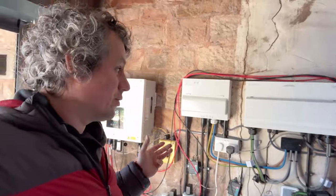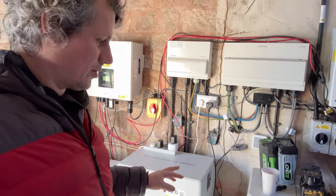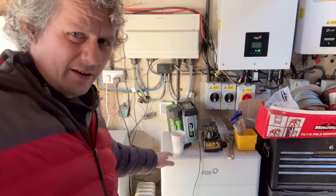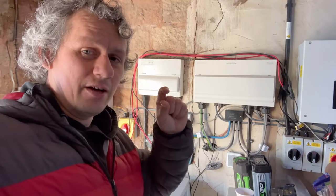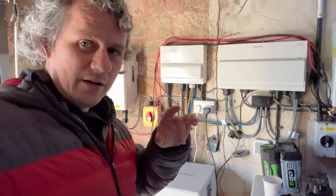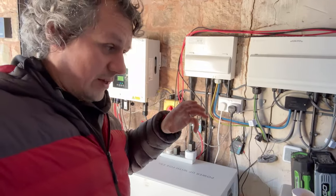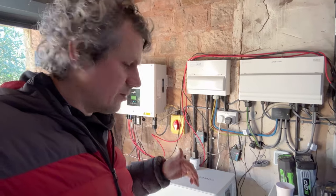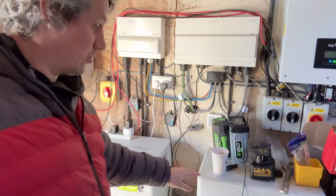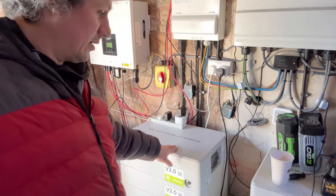I'll run a few cycles and see exactly where we're at over the next couple of days. Last year was a complete disaster in terms of cold weather. What I found this year was this stack actually performed fine — it operated normally, wasn't capped to just 1 kilowatt input from the grid, it charged normally. The other one didn't. Apparently, speaking to William, that will be improved — with the extra two packs on top, it's not affected as much by temperature in terms of voltage increases. So they should now perform the same, meaning I should be able to get full draw from the grid to charge them during very cold periods.